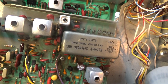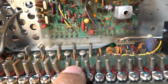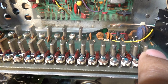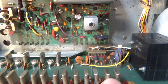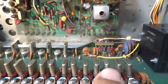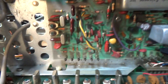Basically how this radio works as far as the crystals: you've got two crystal banks. You've got 16 megahertz crystals right here and four megahertz crystals here. Starting at this end, that'll be channel one through five hooked to the track crystal. You've got a second one for upper sideband, so that would be one through five upper sideband, and then two through eight on AM/LSB, and two through eight on USB — that's how the 16 megahertz crystals work.